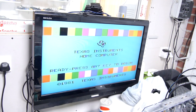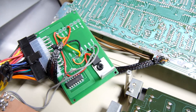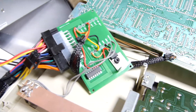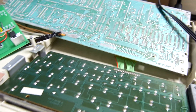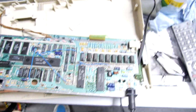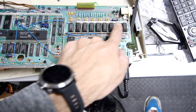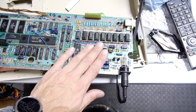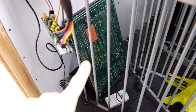And finally we get to enjoy the fruits of our labour. We've got it set up on this little test bench here. I had to modify a power supply board from a Sharp X68000 — kindly given to me by Ian from Monster Joysticks. You can see that little regulator on there, which gives me minus five volts, because these gadgets do require that minus voltage. As you can see, I actually did replace the multiplexer chip as well because that was messing around. And there's my nice bank of socketed memory. All's well that ends well — I get to reassemble this now and move on. So many projects — such as Neo Geo.